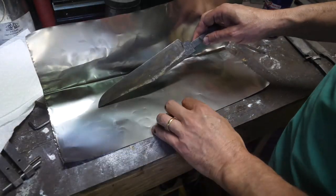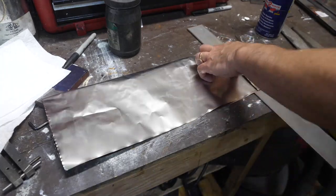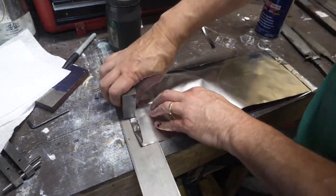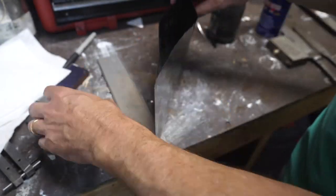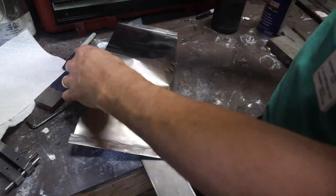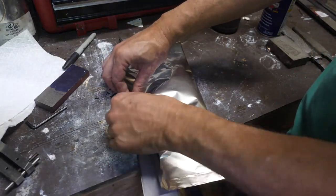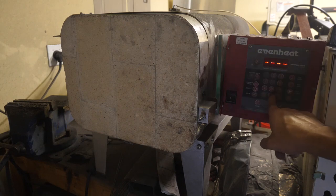Let's see if we can fix this. Perhaps we can put carbon back into those bright areas and make normal-etching high carbon steel out of them. At very high temperatures, carbon migrates down its concentration gradient in steel, so we may be able to move enough from the surrounding high carbon steel into our decarb areas that the bright lines go away. We're going to seal it in steel foil with some graphite — which is carbon — and paper to help prevent leaching of carbon out of the steel from oxygen, and bake it in our oven at 1800 degrees for three hours to see what happens.